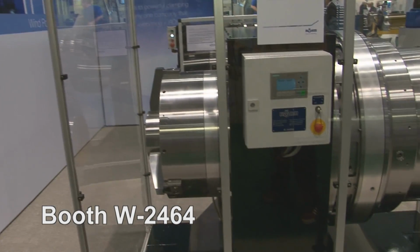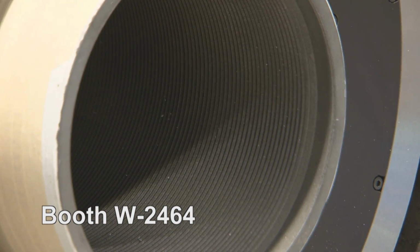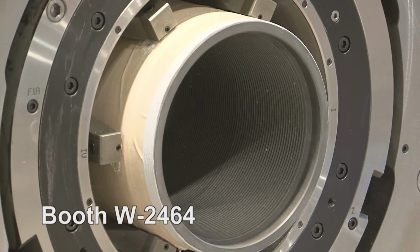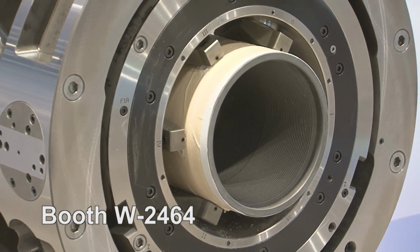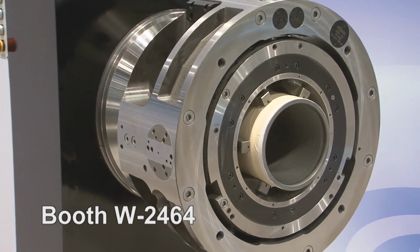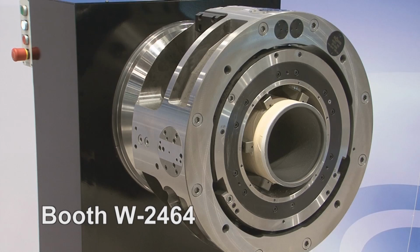Wow. So then we have sort of step 2 over here, correct? That's correct. So the chuck swivels 180 degrees inside itself while the machine is spinning. This enables you to lay down both sets of threads on the same center line. Okay. So we have one last thing over here. Yep. Let's go check it out.